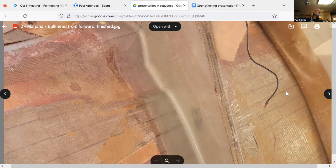That's right. 90 degrees is not good because you just don't have as much pull resistance, right? So all the stress is focused on these strands that are closest to the inside of the angle. If you have a radius, like most boats really, it actually distributes that load more, and you don't have that stress riser right there at the corner.